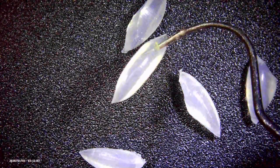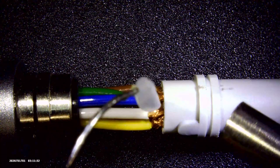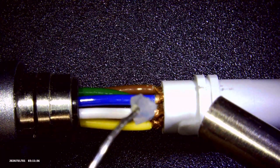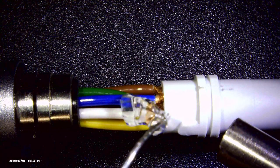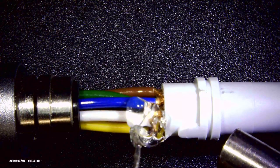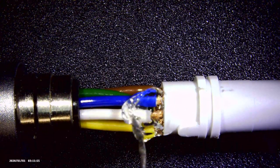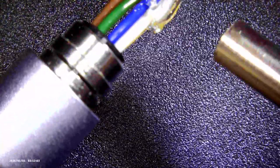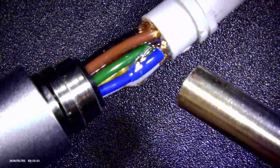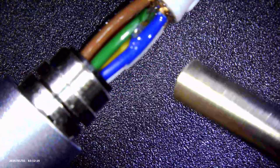Here you can see how I poke it on the end of my stick, lay the connector out, and take a heat source like a heat gun and melt it right onto the wires. You can see it melts very easily. I'm going to start and focus the blob near the connector without getting too much of it on the connector itself — you see me blowing it away from the connector there. That's because your shields are going to sit over that connector and you don't want a bunch of glue there. Put the blob right near all the copper strands, then blow it in between the wires. I also roll the cable left to right and keep it moving — that way I heat up all sides and keep it nice and molten between all the strands.